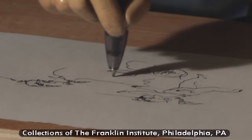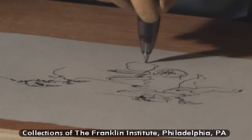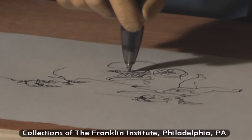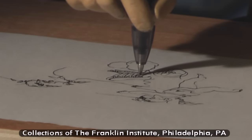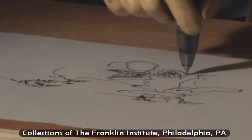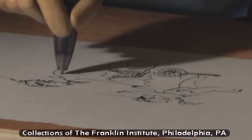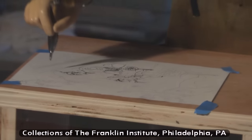Here we are zooming in to show some detail. The reason I'm photographing from this angle is that my purpose in shooting this video was not to show the drawing — it was to show the height of the pen tip to the paper at critical points of rendering these drawings. This video was to document the rendering of the z-axis cam specifically, to show the variations in the pen tip while drawing lines. You can see those very fine variations in height while doing the detail lines.